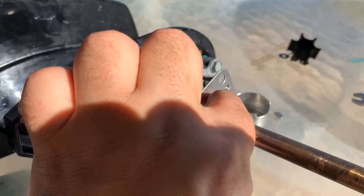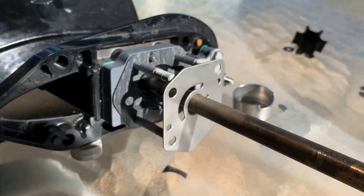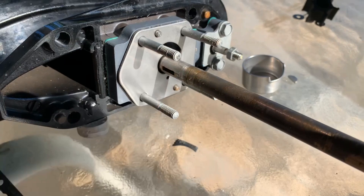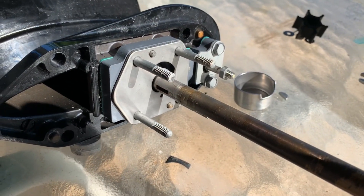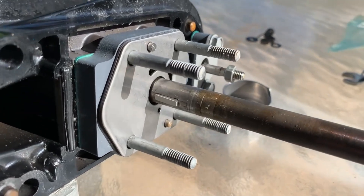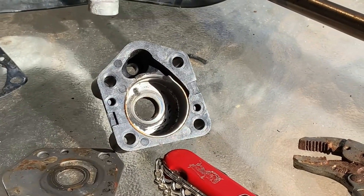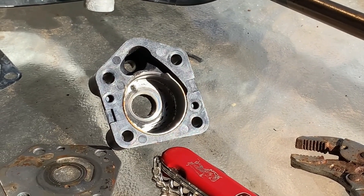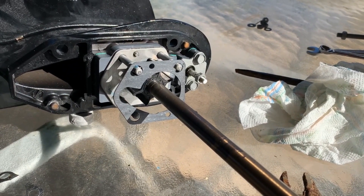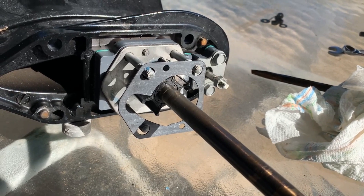You can see me putting the base on - I had to turn it around 90 degrees and it fits into the bolts perfectly. Those two pins are offset so there's no way you can put the thing on wrong. Then we put in the little locking pin - that small rectangular piece of silver on the shaft - which allows the impeller to grip the shaft. You can now see the housing for the water pump, and there's black on the metal where I think sand was rubbing on the rubber of the impeller, melting it onto the housing - that was one of the parts of the failure.